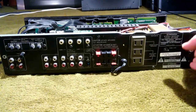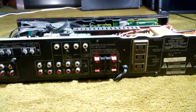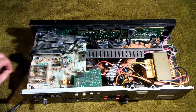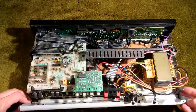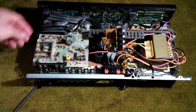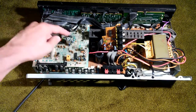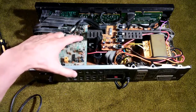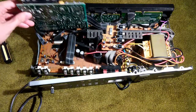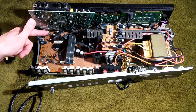You just got to pull them all out. We've pulled out 18 screws so far. Now this back plate is loose, and that input card is loose, and we have one little screw here holding on this board — that screw is right there and it's going to have to come off. With that screw removed, I can lift up this board, and right there at my fingertip — there's your memory capacitor.